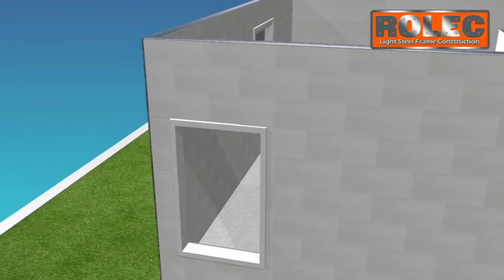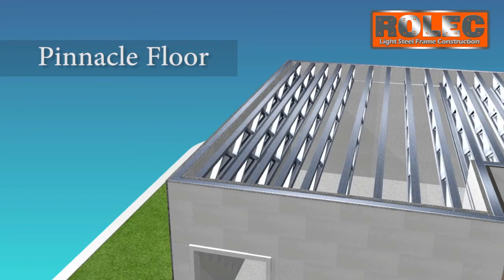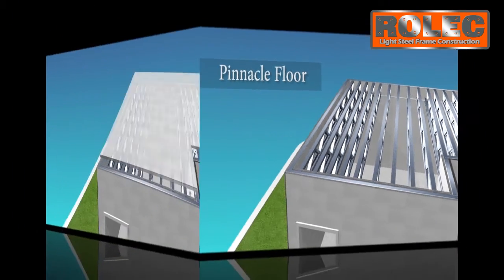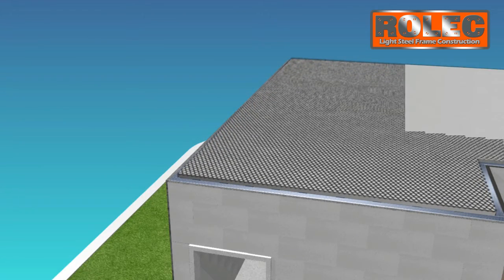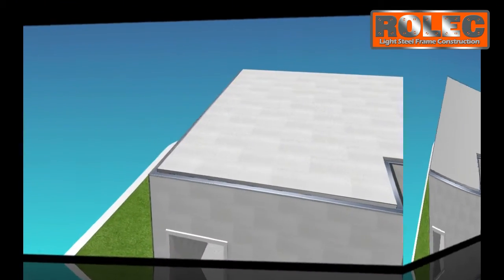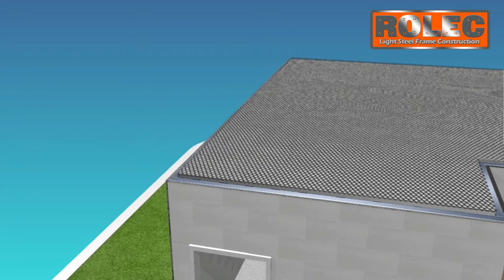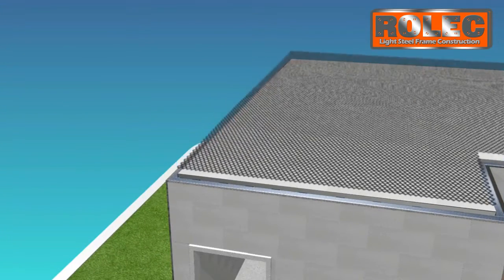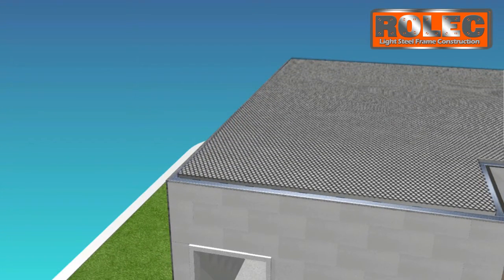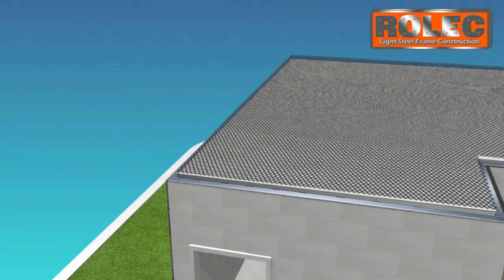The Pinnacle floor. Step 5: Screw the plate hanger in the place of inner concrete form tiles and screw joists in place. Step 6: Screw concrete form tiles upside down onto the joists. Step 7: Place welded wire mesh on top of concrete form tiles, then cast 25 MPa concrete on top. Step 8: Cover with floor finish on top and fit conventional ceiling underneath joists.